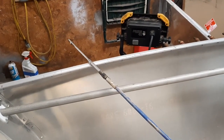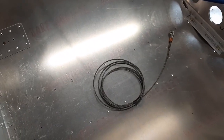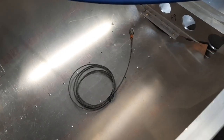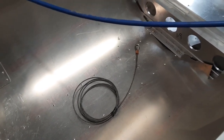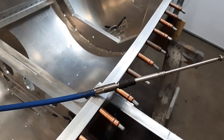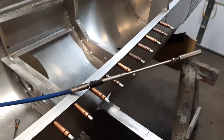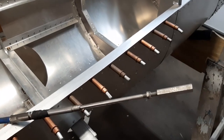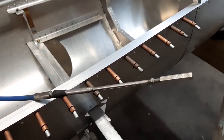You can't inspect everything on these push-pull cables. If Hummel had wanted to use a regular cable for the elevator, you could make that work — that would have been fine. But trying to run it to the ailerons with as many direction changes as you've got, you'd end up with pulleys; it's just better with rods and bell cranks there. The Minimax used push-pull cables and that was about the only thing that worried me — as long as they're working good they're smooth and easy to control. You can screw on whatever attachments you want on the threaded ends; the Minimax used a ball and socket so you could spring-load and snap them on if you needed to take the wings off, which worked really slick.